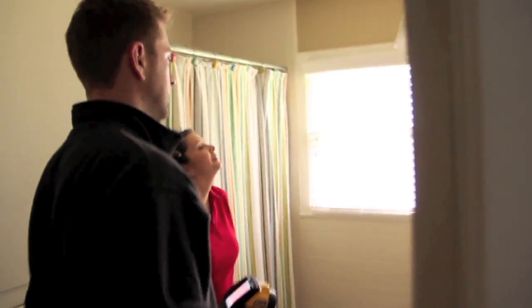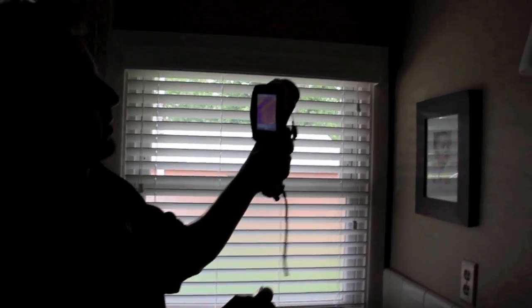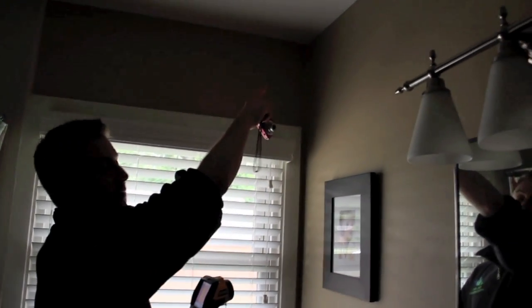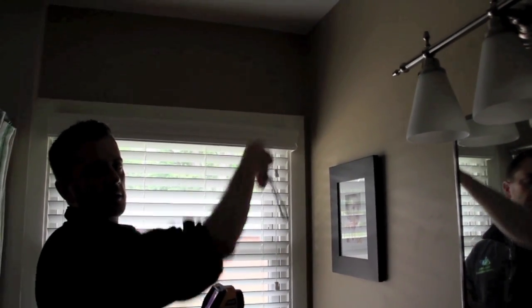This looks like a plumbing wall — they actually built the wall out to put a plumbing vent stack behind here. I would bet there's a plumbing stack that goes through here up into the attic, and that's what you see with the infrared camera: just a big dark area on the wall. Where that plumbing vent penetrates the ceiling, we need to get into the attic and use expandable foam or caulk to seal that opening so that you don't have air leakage occurring.